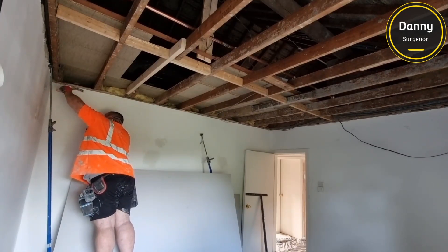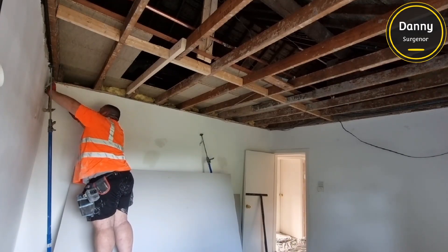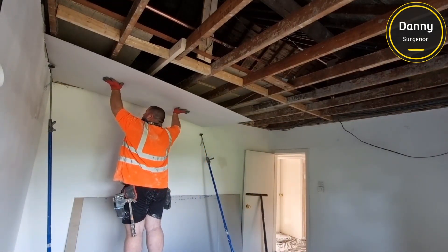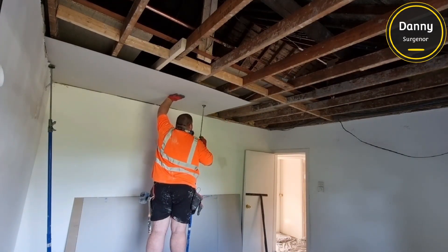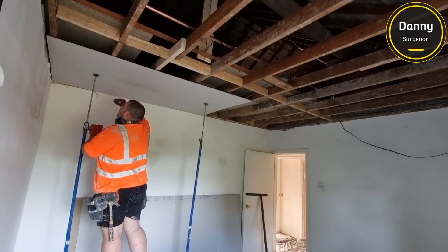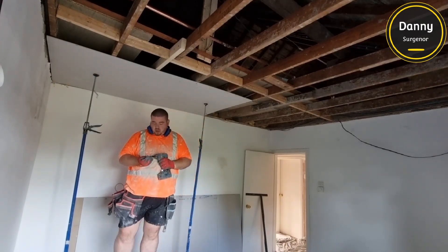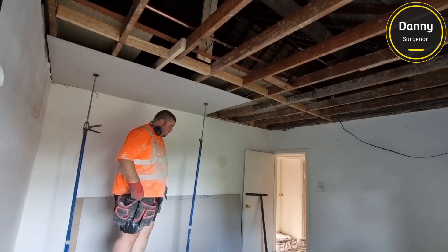As you can see, the plasterboard prop here on the corner — the one sitting against the wall — what that's going to do is catch the edge of the board for us, and that'll allow us to manoeuvre our hands. It'll also stop the plasterboard from cracking. You can see it just holds it on that side until we get this side propped up, and then we'll go to the other side and slide it in. This is something we'll do consistently throughout this job.